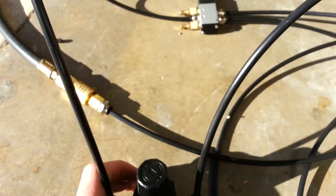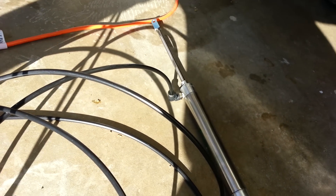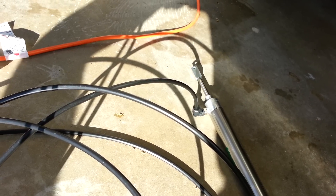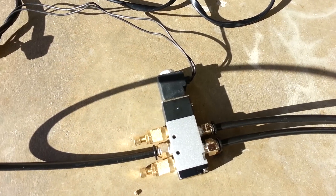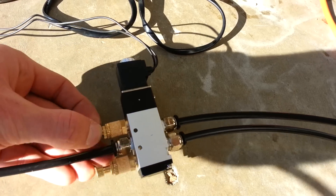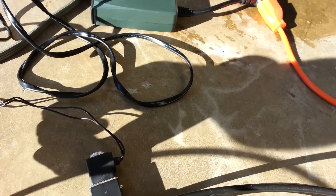To test it, my solenoid switch has a little manual override, so I can just press the button — and there it goes. I have it configured so that it slowly leaks out, letting the coffin lid shut slowly so it doesn't hurt anyone. I can twist and turn the cylinders to control how fast it opens and shuts.